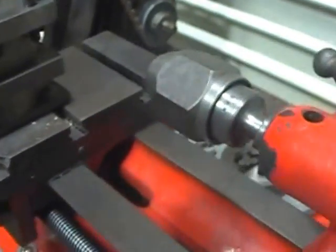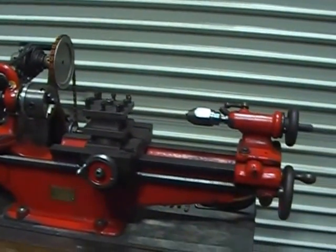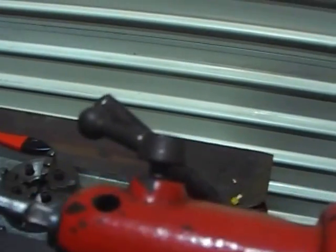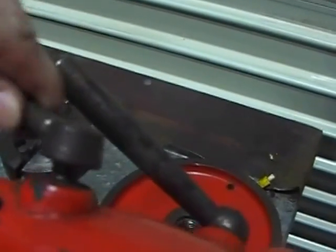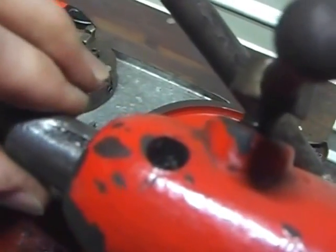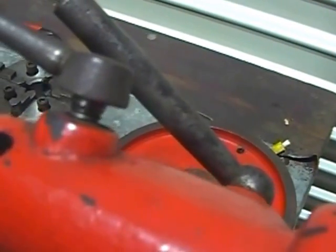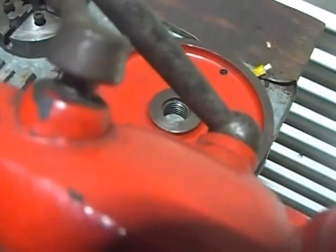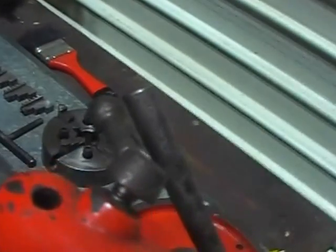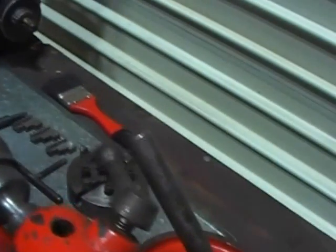Remember, this is an old item and British-made quality - I'm sure it has many years use left. The tailstock - I believe this is Morse Taper 1 - comes out a nice long way, which is good. It's just worth pointing out that this locking arrangement, which has a pin into here - I suspect the whole arrangement should be round with this upright and there should be a slot in that hole, and this just locks the shaft. This actually works by using the slot from the end to both lock and locate, which is fine, but when you're going in and out you just need to loosen it off, but not too much, otherwise this whole unit rotates. So that could be improved - I've never found it an issue, you just learn not to over-tighten or over-loosen that.